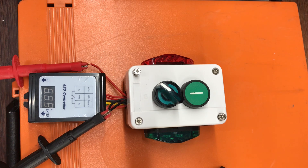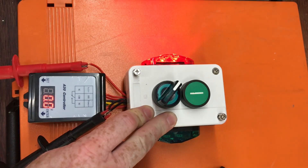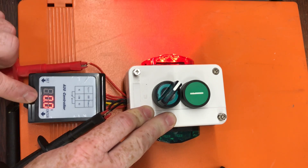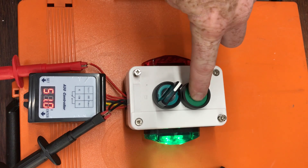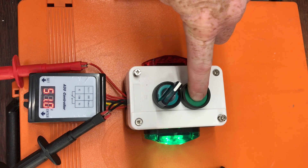I've got everything hooked up now — the controller is connected to the DC power supply on my bench here at 51 volts DC. To pre-charge the circuit, you turn the switch on, which gives you the red indicator saying don't switch the DC breaker because there's no voltage on the caps. Once you push the pre-charge button — I haven't added the resistor in the circuit, it's just wired directly at the moment — you push the button, you get the pre-charge, you'll see the 51 volts come up, then you know you're safe to switch the DC isolators.